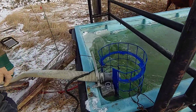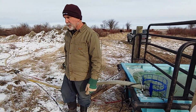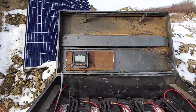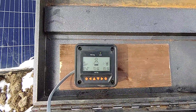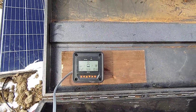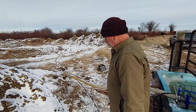The trough was bumped so it just started pumping again. Now that it's pumping, we can see that the load is drawing 24 volts, 12.2 amps. That's all that pump draws, and it's moving up about 15 gallons a minute off of that little amperage, which is pretty neat — a lot of water for a little bit of power.